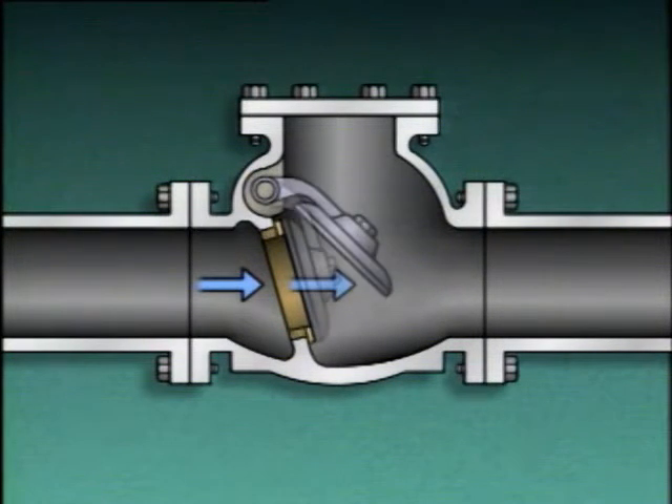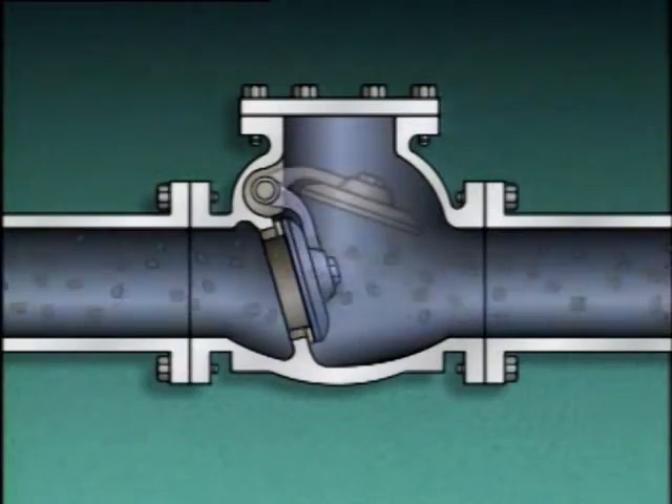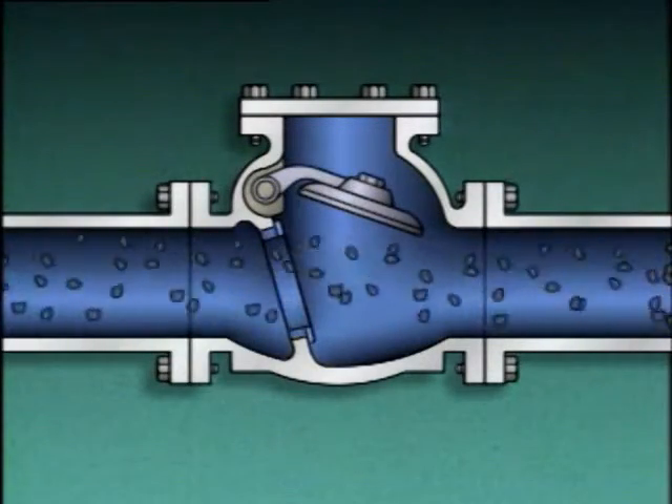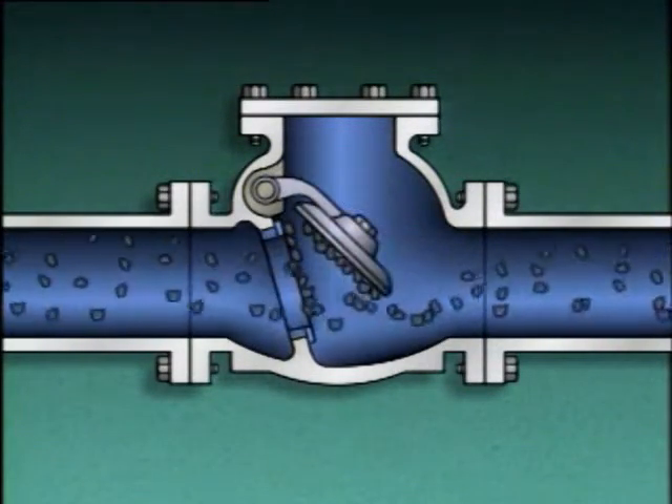When you detect this kind of problem, report it to your supervisor. In addition, swing check valves aren't very effective for controlling the flow of fluids containing solid particles, because solids can accumulate between the disc and seat and prevent the valve from closing. Since swing check valves may not close due to buildup of solids, you should never rely on check valves to isolate a component or system from fluid pressure. This could be extremely dangerous when a process system is about to be opened up for maintenance — always shut the appropriate isolation valves to ensure the system is properly isolated.